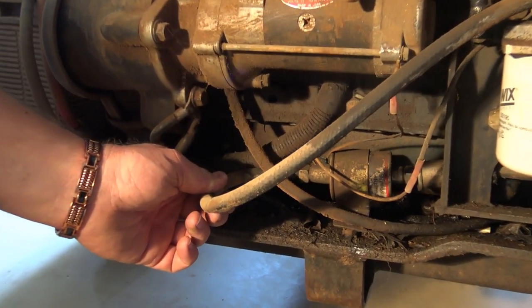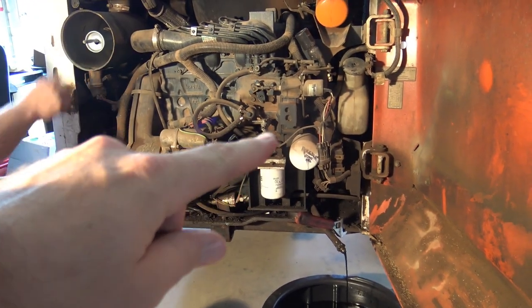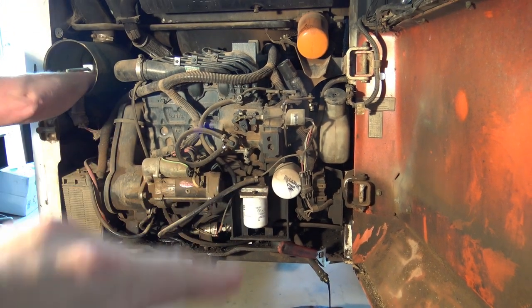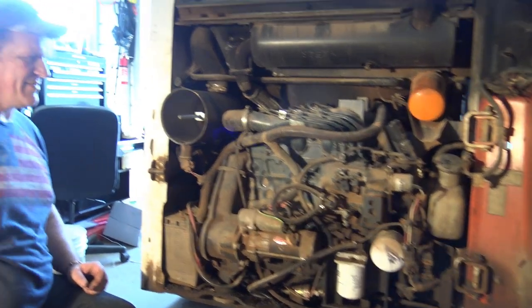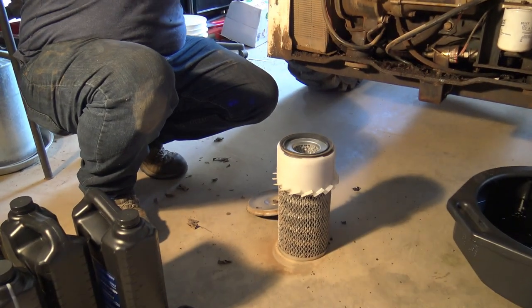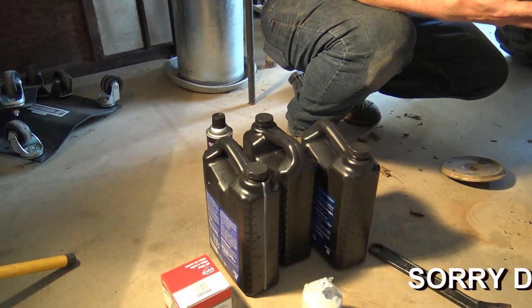This thing has been, some time in its past, retrofitted with an electric fuel pump. So guys, with the fuel filter here and the oil filter here, we'll just be taking these off and hand tightening, putting new ones on, and we'll refill the oil through the oil filler neck right here — pretty simple, pretty easy service. He's checking out the air filter now and found some leaves in there. That's the inner filter and that's the outer filter. We take 7.5 quarts of oil in this job.